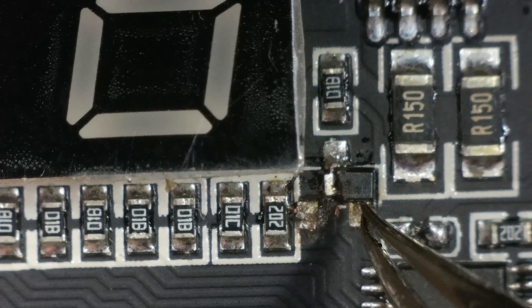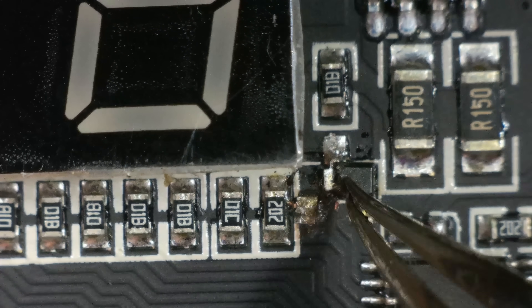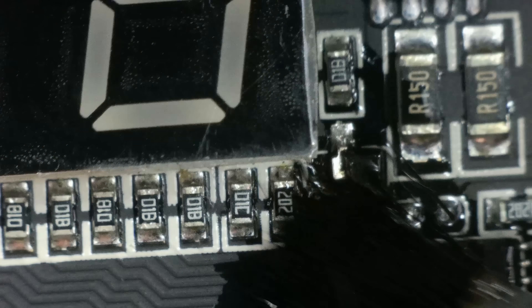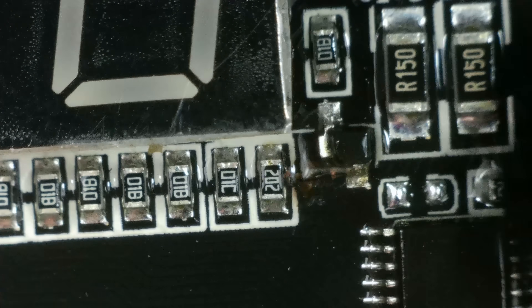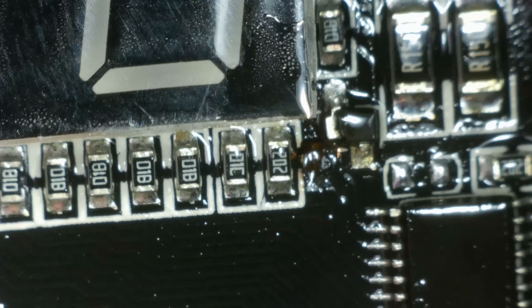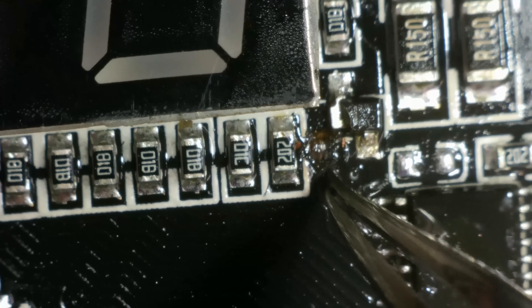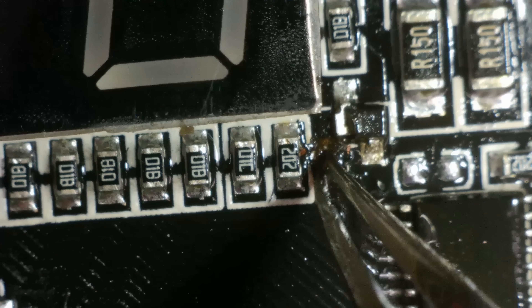But how am I going to know what that chip is? It looked like I had a Y on one side - I think it's all burnt away. Let's clean it with some isopropyl alcohol. Well, that hasn't really helped, I'm still none the wiser. It's really difficult because it's a black circuit board. It looks like it's burnt right through there, and that trace has obviously now come off.